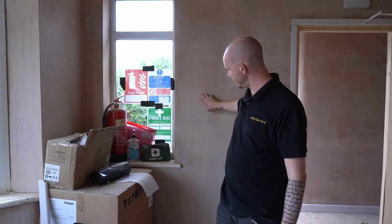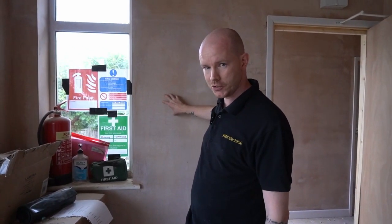A lot of you won't know what I'm going on about. When you plaster old walls, you PVA it — you use a watered-down PVA and water mix, you brush it or roll it on the walls, ceilings, anything you want to PVA except for plasterboard. You do it because it creates a barrier between whatever you're plastering and the wall. You wait till it goes tacky — not fully set, not wet, just starts sticking.